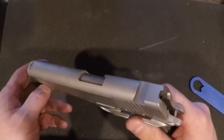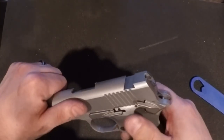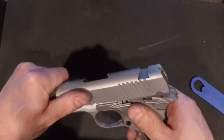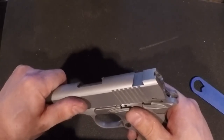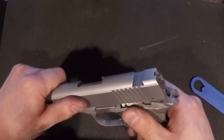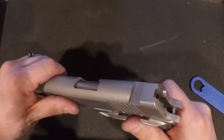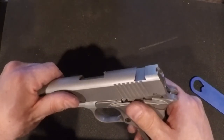Lessons learned: once you cut those bottom lugs you'll be able to get the thumb safety on, but when you put it all together it's going to stick - right here - and you can force it into battery and wonder what the hell is wrong. It's just those top lugs that mate with the lugs on the inside of the slide. You just have to adjust those a little bit and then you're in there.